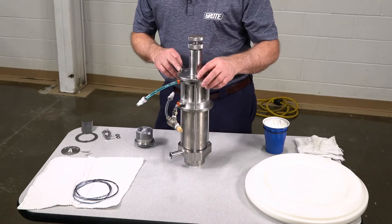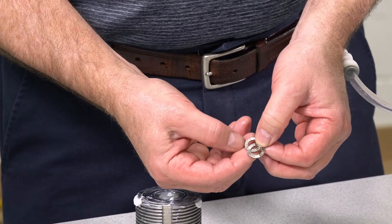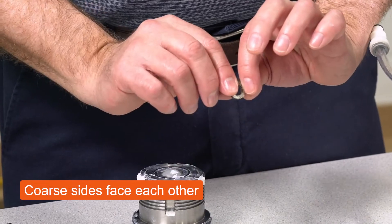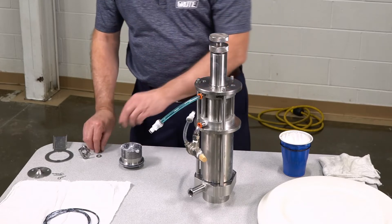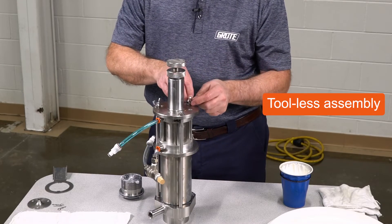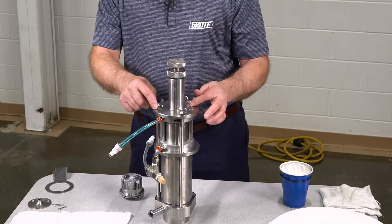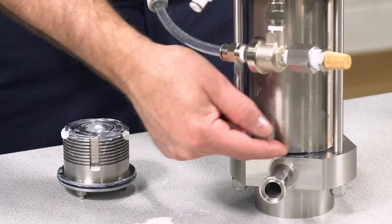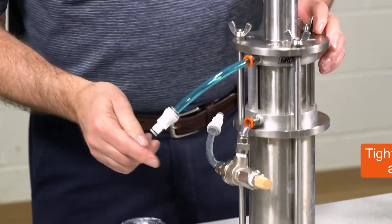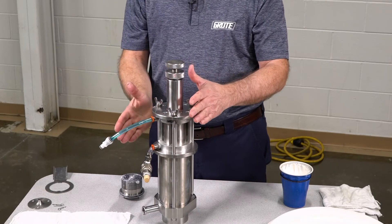Next we're going to install an anti-vibration washer on the top first. That washer is a two-piece washer. There's a coarse side and then there's a fine side on each one. You want the two coarse sides together so that the fine side is facing out top and bottom. This is a tool-less pump — you shouldn't have to use any tools to assemble or disassemble it. Once I have the wing nuts snug, I'm going to pull them down evenly so that the gap down here gets closed off, turning one just a little bit until I achieve that. And once they're snug, that's it. If I turn one down all the way and tighten it first, it will cock the pump to one side or the other.